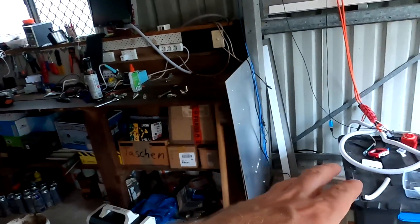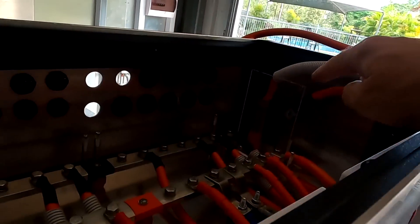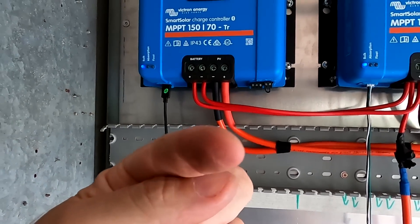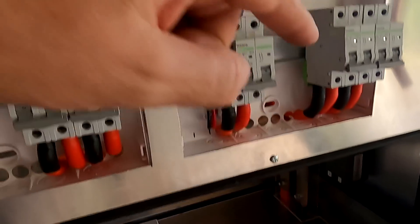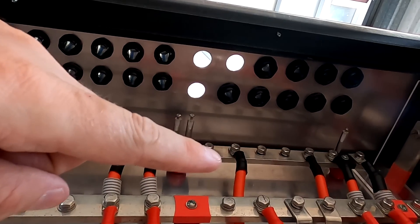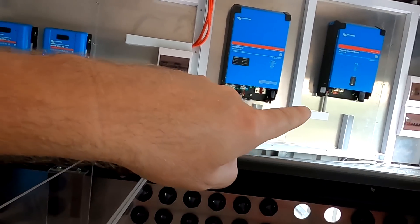Next video, 100% we are doing it. Tomorrow morning I've got a whole day — we're disconnecting the battery. We also have to take out the smart shunt; it goes in the gap between the bus bar and this cable, then we use 25mm cable through our glands to our main bus bar. That sounds like an easy task. Then we reconnect the battery to one of the circuit breakers which supplies power to our bus bar, where the solar charge controllers are connected. We just need to connect the fuses through our glands to the DC side of the inverters.